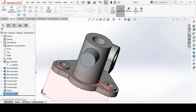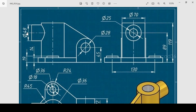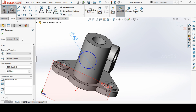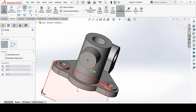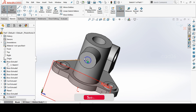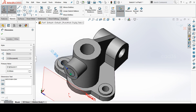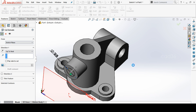We forgot to add the dimension: 48mm diameter (or 45mm diameter) and a 25mm hole. Make the hole dimension 25mm. Go to Extrude Cut and make the hole up to next. Done.